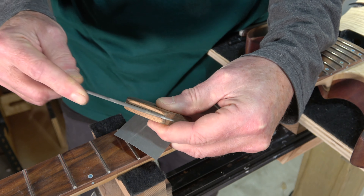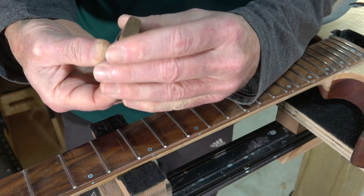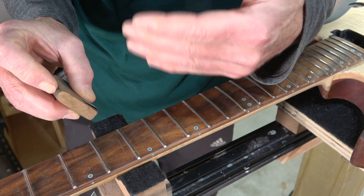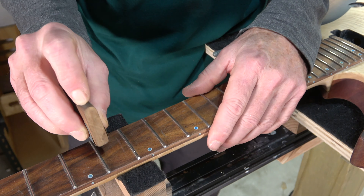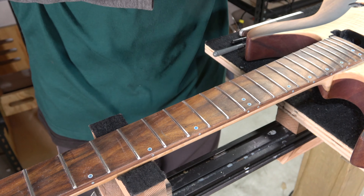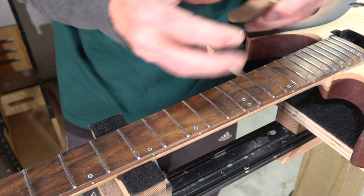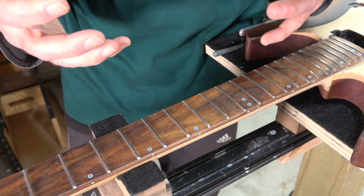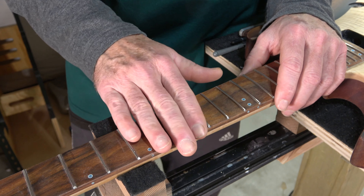In the past, what a lot of guys do is cut a strip of sandpaper and wrap it around a block of wood. I formed a groove in the center of this edge using one of these little round microfiles, then would wrap the sandpaper around it. I'd typically start with 400 to 600 grit and work my way up through the grits to 1000, then proceed with polishing. The problem with that approach is that because you're holding the sandpaper with your fingers, after a while they start to cramp up and it gets really uncomfortable, causing you to take much longer than necessary.